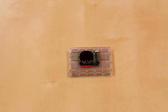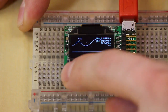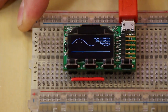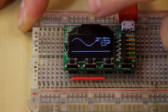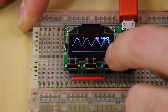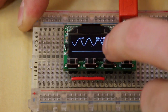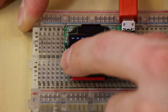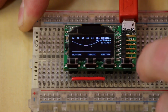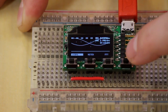With the four buttons you can do a lot of interesting things. We've got the waveform generator output plugged into the channel input on the oscilloscope. So we're sitting there generating a 10 Hz wave, and we can use these buttons to change the scale of the wave. It's a pretty neat little oscilloscope, and we've got a menu system where we can select the different channels, generate different types of waveforms, things like that.